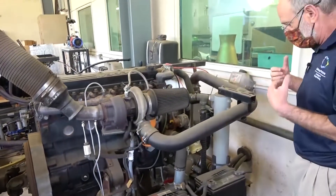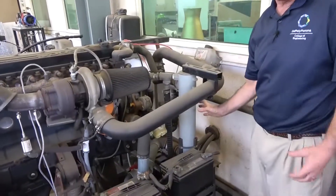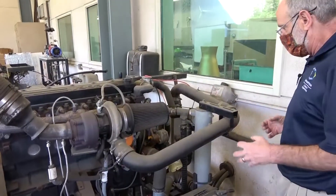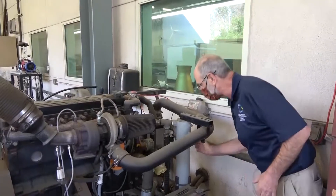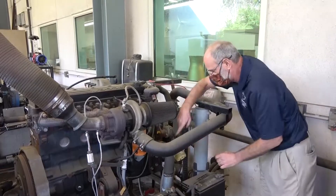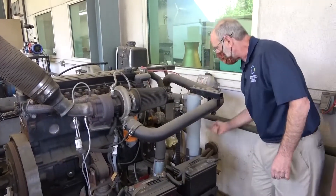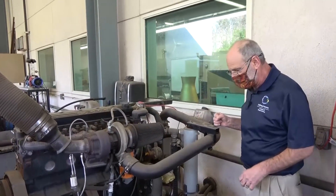What we can also see on this side is the cooling system. This right here is a marine heat exchanger. If this diesel engine were used on a yacht, it would be hooked up to a water-to-water heat exchanger rather than a radiator — which is what we use here. The engine coolant circulates into the engine and the water from our building water supply circulates to the other side of the heat exchanger, providing cooling for this engine.